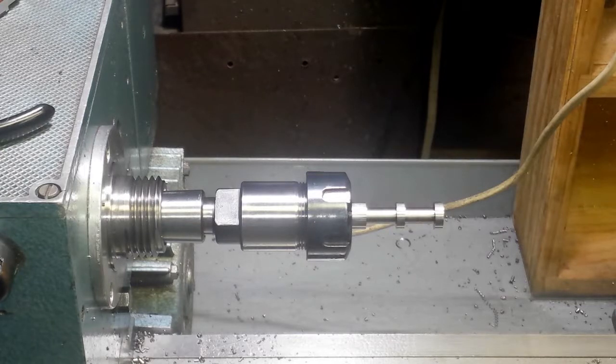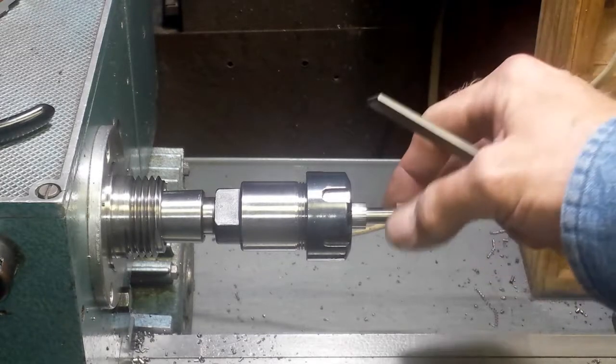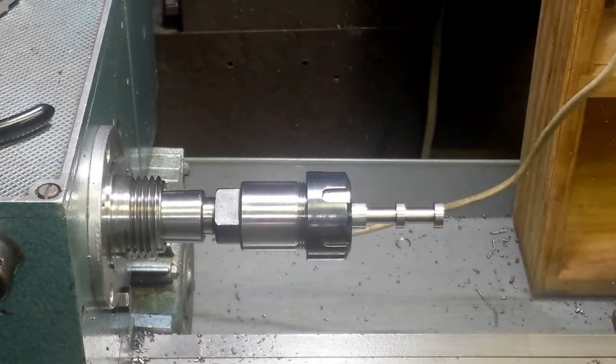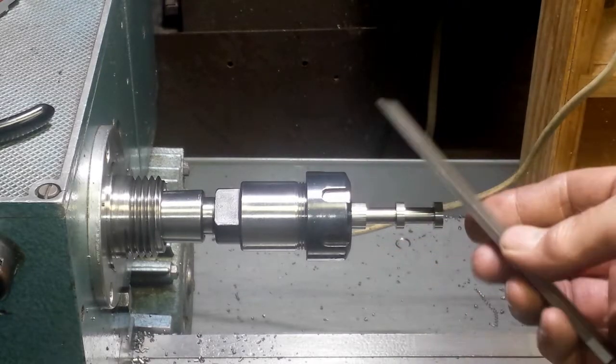There's a shot of the valve before I clean it up and remove it from the lathe. These diameters are already fixed — that shaft was 499.5 thousandths. I don't want to remove any of that because I've got it sized to fit the bore in the head perfectly. But I've got to make sure there's no burrs on it, and yet I want to keep sharp edges on those valves. So what I'm going to use very carefully is a file.